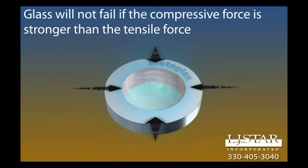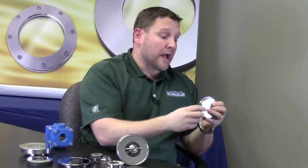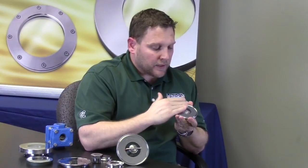What the glass experiences is a bending moment, and that bending moment travels through the surface of the glass and into the ring itself, so it doesn't allow the glass to rupture or fragment and be released into the operator's face or into the process. On this particular demo piece, the inside surface — the process face of the glass — is completely unaffected by the over-pressurization.